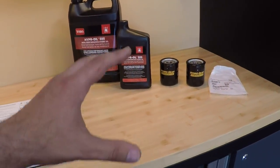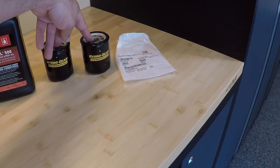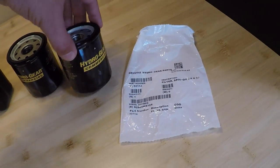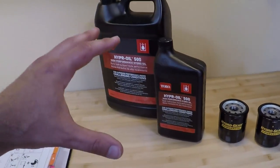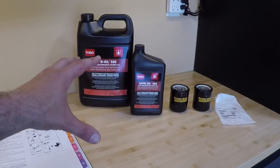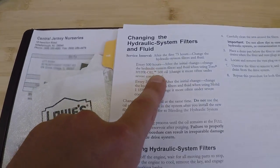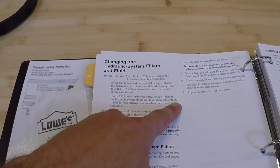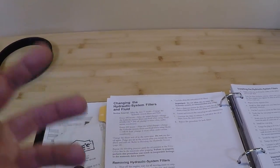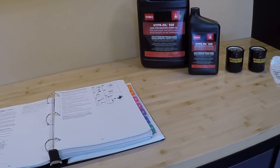As far as what Toro recommends, you can buy ready-to-go kits from Toro. But what I'm going to do is use the original style Hydrogear commercial filters, part number 52114 — it also says it on the filter itself. And I'm going to be using their Hyper Oil 500. If you use Hyper Oil 500, that gives you a 500-hour service interval, which is also recommended in their maintenance book. You can also use Mobil 1 15W-50 synthetic engine oil, which gives you a 250-hour interval. I probably wouldn't go 500 hours, especially being residential — it would probably take me 10 to 15 years to cover 500 hours anyway.